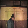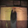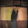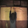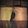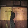This is how we use a tillering board. And we put another bow up there that is, I think, more of a fine tillered, been tillered a little bit more. This one here still needs to be worked on. You're putting the blocks in there to keep the bow flat. You want to get the handle section here straight, even with this line here. Oh, okay. So that you don't start off cockeyed from the beginning. So you get this straight, and then work the limbs down from there.